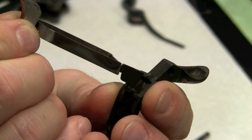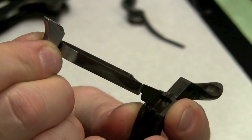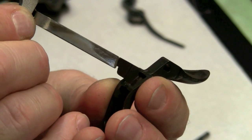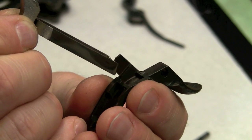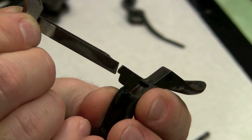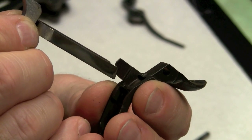So here's a position where, when the grip safety is not depressed, it prevents the rearward motion of the trigger. If I try to press the trigger, I cannot. It's hitting the grip safety as it should. When I depress the grip safety, it moves in this position, and now it clears and can move back and set off the sear. You follow me? So this is safe, and this is depressed and allows the rearward travel.